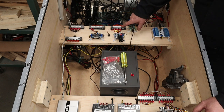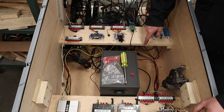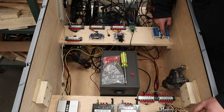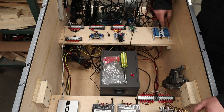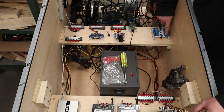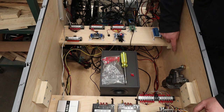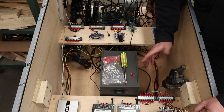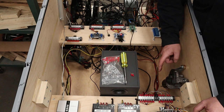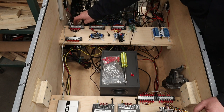The wiring for this is pretty simple. We're going to take a yellow line from the 12 volt positive and it's going to have an inline 10 amp fuse — I chose 10 amps because these relays are rated for 10 amps, so if anything's wrong and it draws more it'll pop the fuse and save the relay. That's going to come into the center connection of the three for relay 1. You look at the board and it'll say R1, R2, R3. We want the normally open connection — that's normally off, and when you trigger the relay it'll close — so we want the one to the left. We'll run a yellow line to one of the connections we tested. On the other connection we'll have a black ground wire going all the way over to our grounding common zero block.